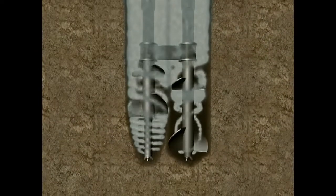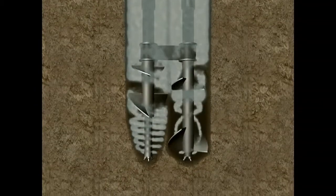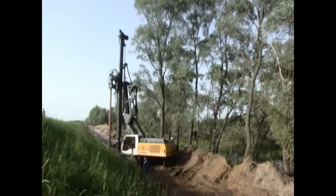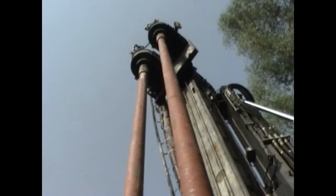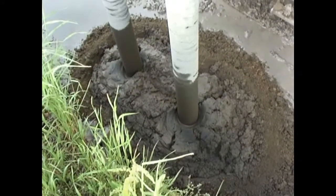On this job site, the double mixing drive is driven by a Liebherr LRB125 piling and drilling rig. This carrier machine is ideally suitable for work on confined job sites and offers enough power for mixing at 15 meters depth due to its 450 kilowatts engine.